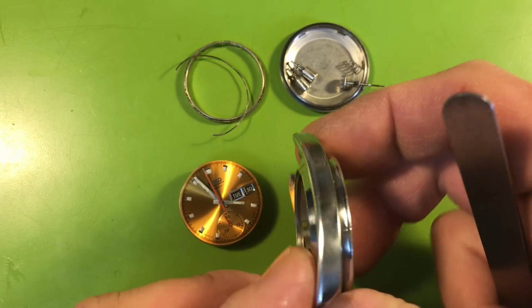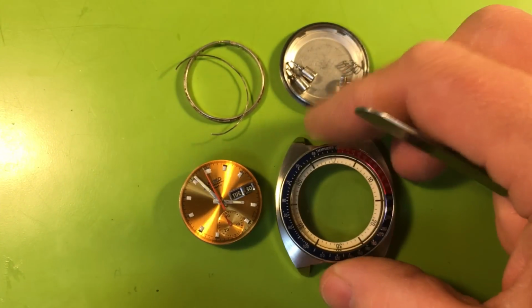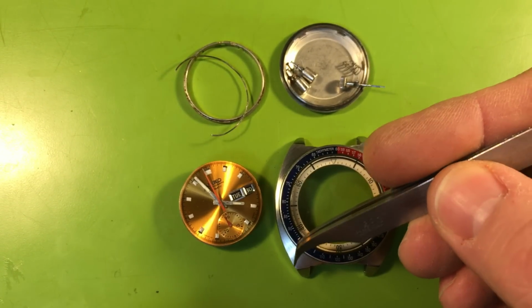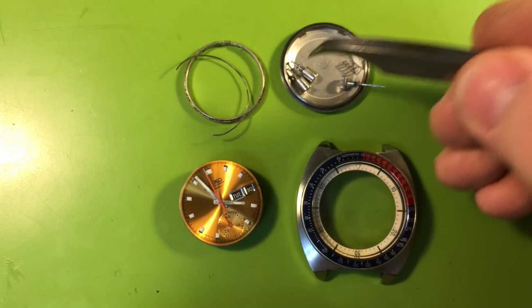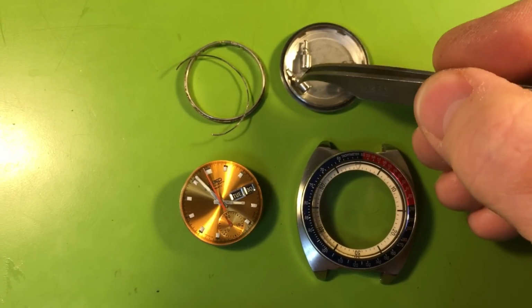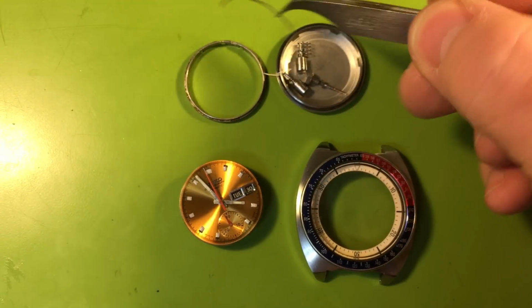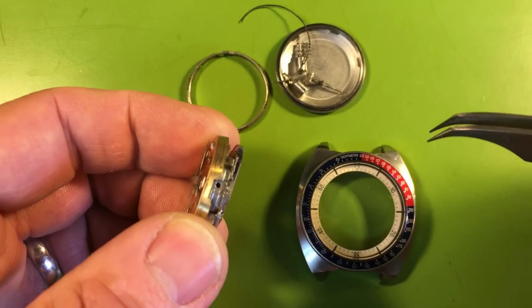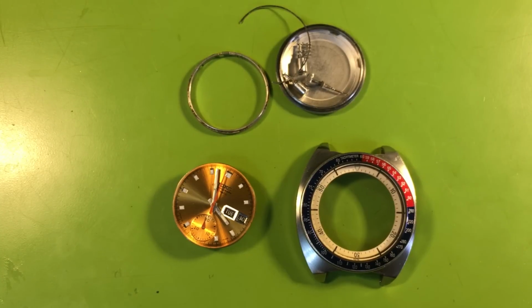So you wanted to know more about what I found inside. There it is. That's what I found. Fake dial, aftermarket bezel and insert, heavily repolished case, faded but original indicator ring, one missing spring, no seals, handmade stem assembly, a bad movement ring spring, rusted movement ring, handmade dial ring. That's what you get when you are drawn in and trusting. So you wanted to know more, and there we are.